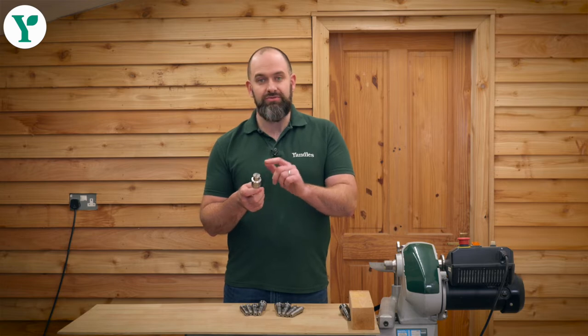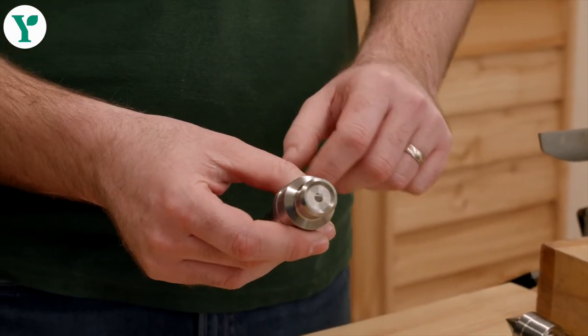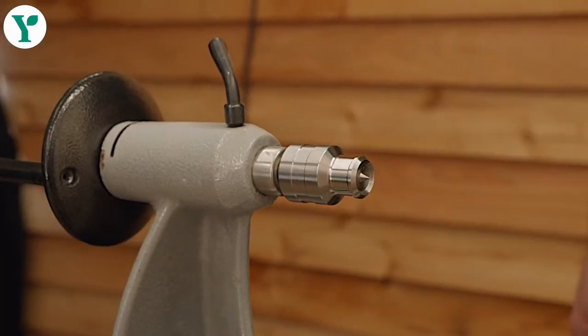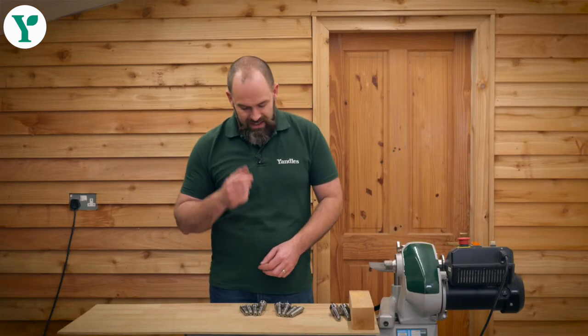They also have a larger body but it's a ring centre, so it's much better for gripping on the end of pieces that have been paper glued together, or on any punky wood and that kind of thing, because you've got the whole ring there to grip with, not just four points. They would go in the tail stock of your lathe.